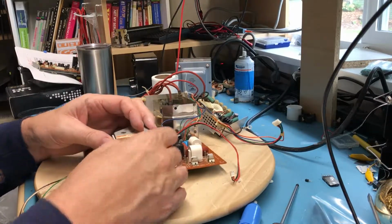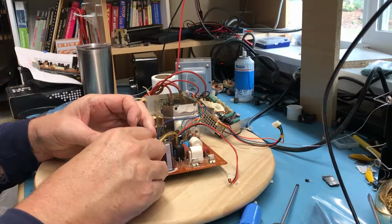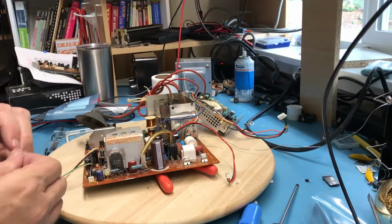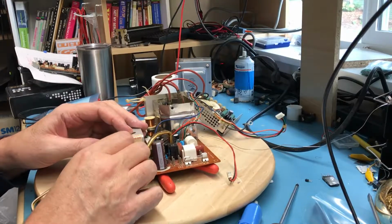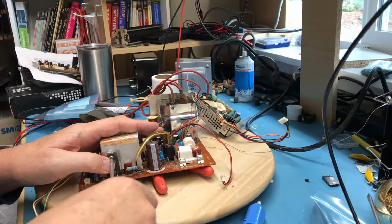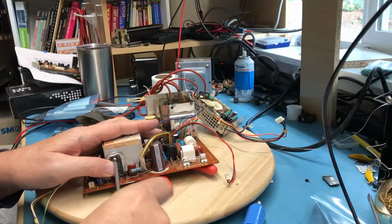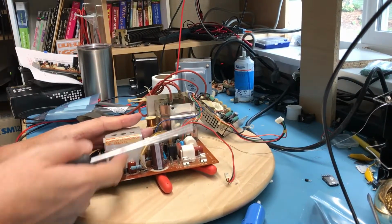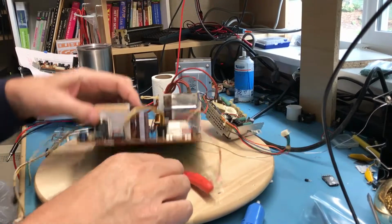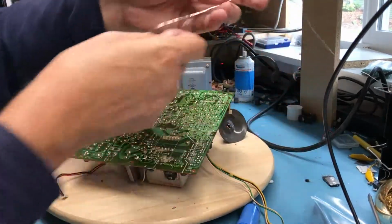Of course, it's rather difficult to get those to all line up. They are in. I do believe all 5 are through, and they are. And the screw's engaged. And again, I'm going to screw this down before soldering the leads. I've said it several times in this video series, I know, to reduce mechanical stress. And you can see the heatsink compound kind of squishing out around. I always use too much. Got my 5 nice leads there poking through.